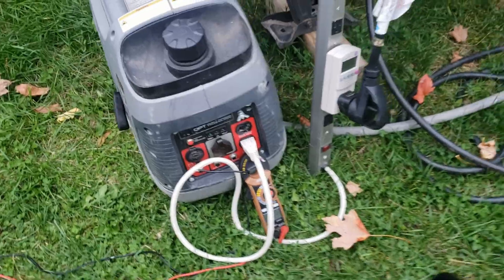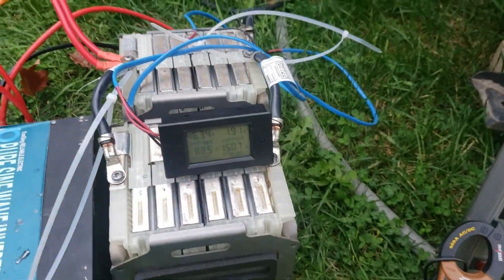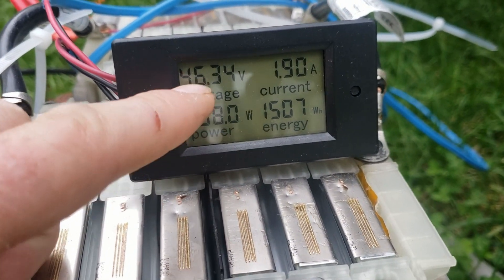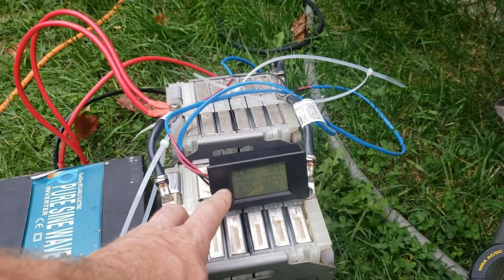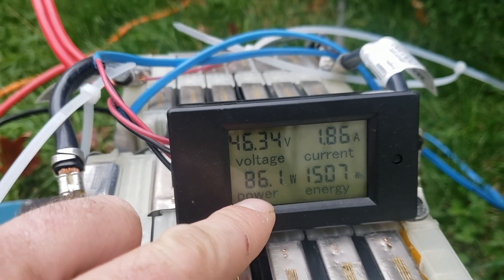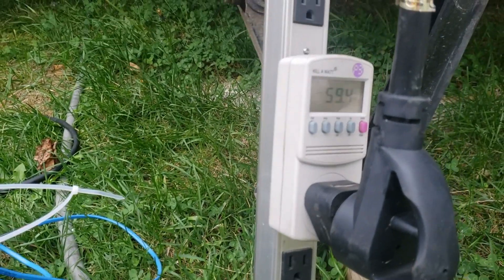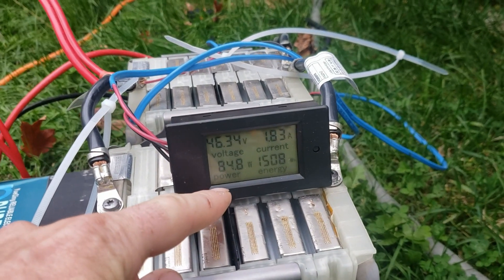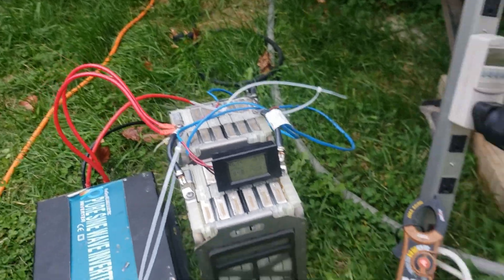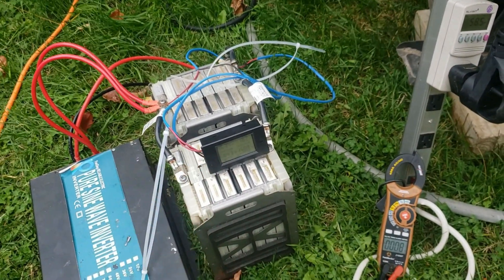Now for the new test setup — running off a small inverter with very small batteries. This is the meter for the small battery bank: battery voltage at the top, watts at the bottom, and amps being pulled from the batteries. It's a 48-volt battery bank currently sitting at 46 volts since the batteries are fairly depleted — full charge is 50 volts. We're currently pulling 86 watts on the DC side, with 124 volts and 60 watts on the AC side. The difference reflects inverter inefficiencies. We have three meters to cross-reference.